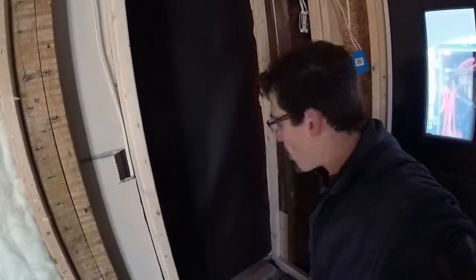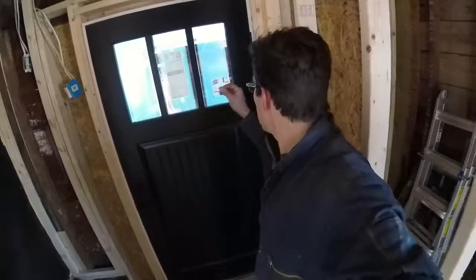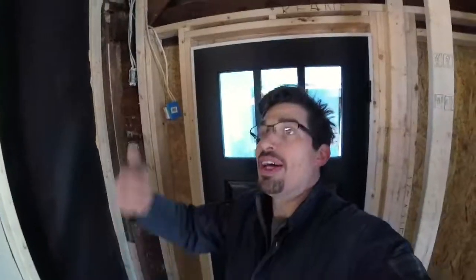We've been doing some work on the outside. We have to reskin this and put new shingles in here because there just wasn't enough meat between here and the house. So that wasn't something that was expected, but it's not too big of a project because we were going to cedar shingle the front of this and the door that we're removing outside. So you see the kitchen door in the pictures, and that door is going to come out tomorrow, and the same thing. That's going to get boarded up, and it's going to get skinned, it's going to get felt papered, and then it's going to get the cedar shingles put onto it.